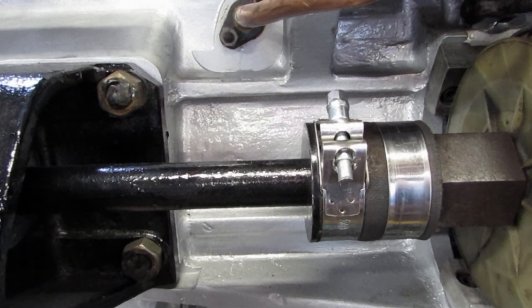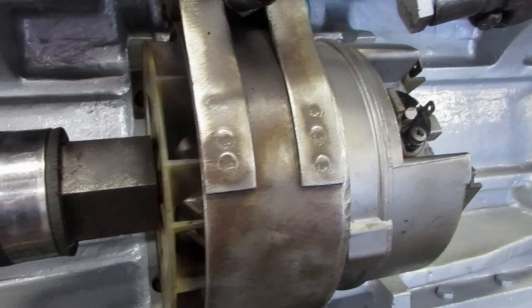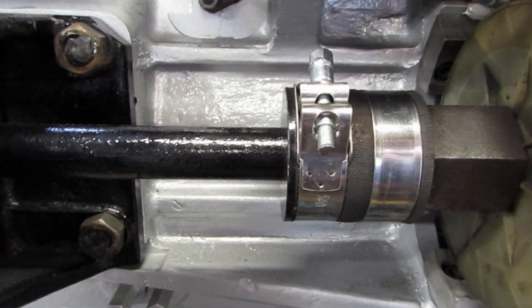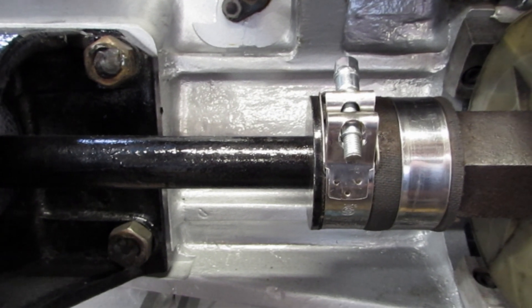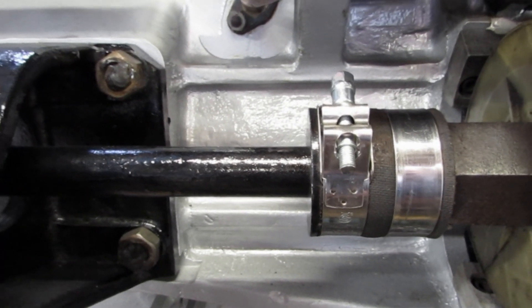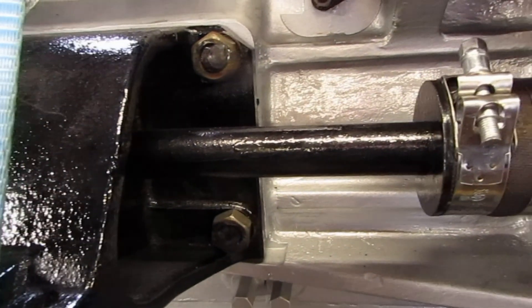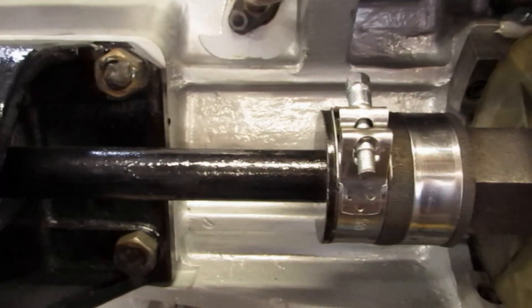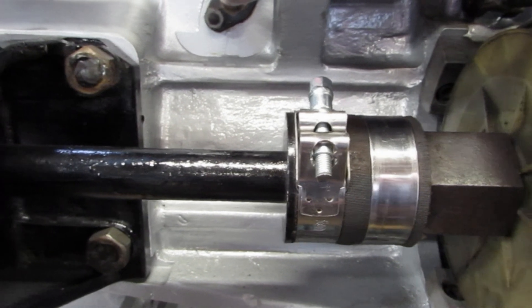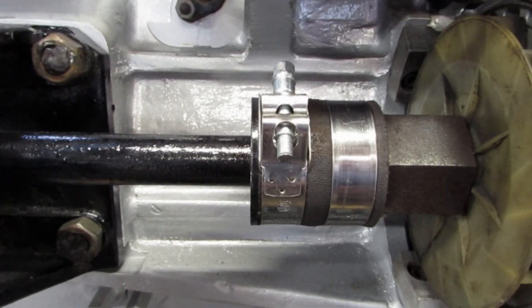Another challenge we had was these flexible couplings on the AC5 alternator, and I will have taken you through that alternator on other videos. Normally these flexible couplings are kept in place and kept tight with four hose clips, but we took the decision instead to use two very heavy-duty hose clamps — we've done this in the past and it has worked out fine. The health and safety executive will have a kitten when they see this shaft, which rotates at 1.8 times the crankshaft speed. The end user is going to have to work out a way of covering these shafts and keeping them safe for personnel.